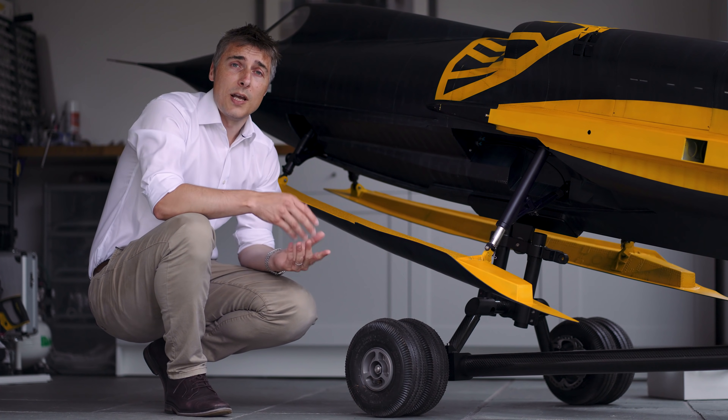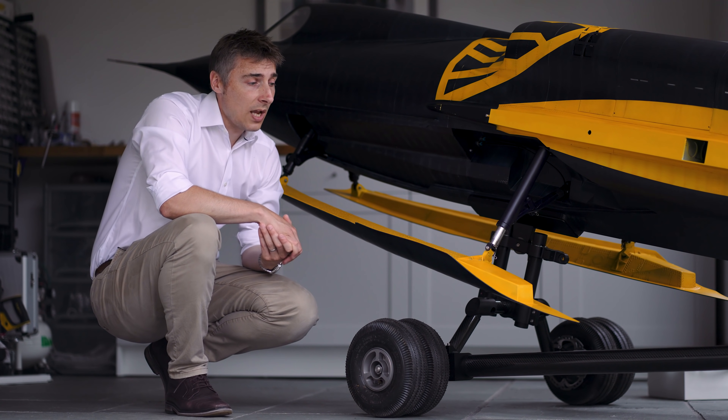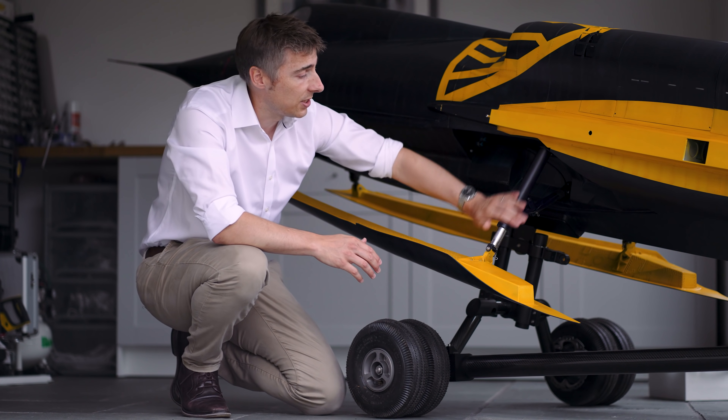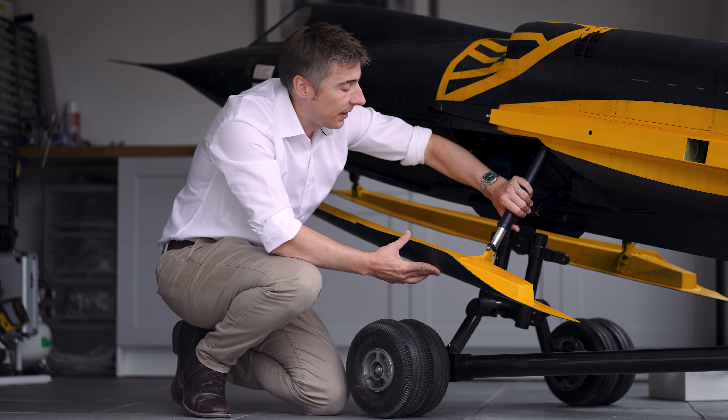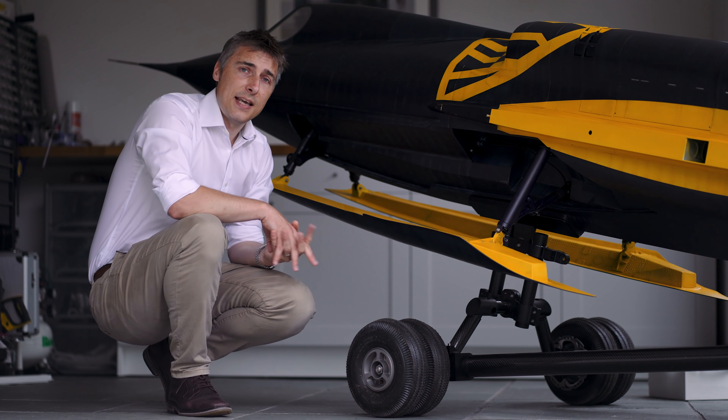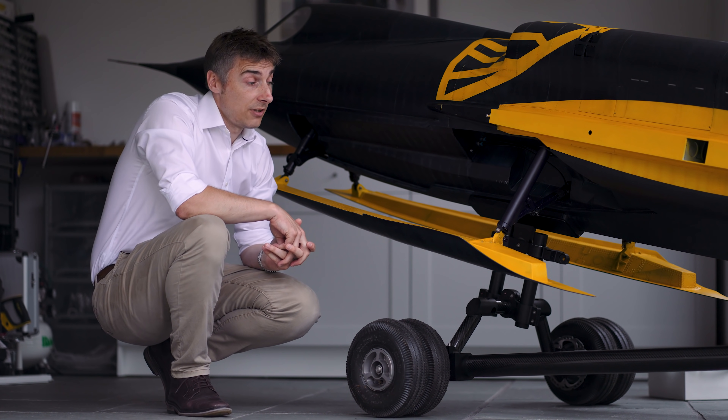It's a nice stable turn, but we have to back off the power and we can't explore that phase three acceleration. To cure this, we're going to change the actuation to hydraulic. In turn, we need to change the ski angle for the phase one and two accelerations.